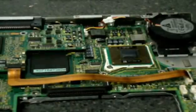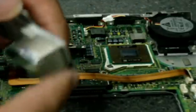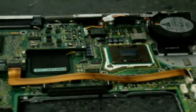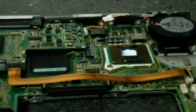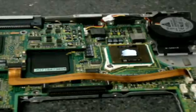This is a great time while the unit is apart to inspect the heat sink. This one's clean because I just cleaned it out. You want to get all the hair, dirt, and dust — everything that collects over the years. Clean the CPU with a little rubbing alcohol and put some CPU compound on there, dab it in the center, and that's going to keep it running nice and cool. Definitely great maintenance to avoid thermal failures.